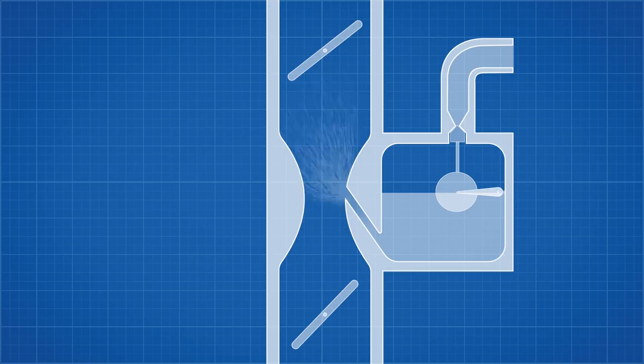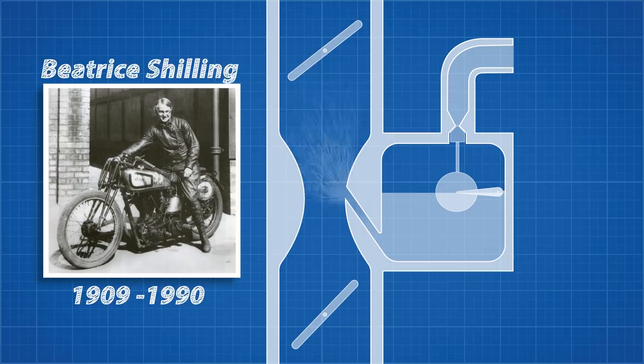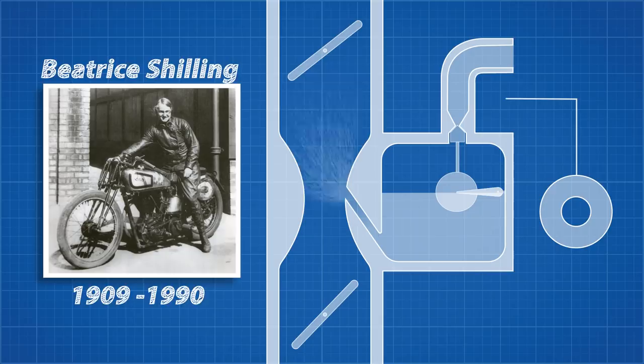With the war raging, Britain needed a quick fix, and this was where Beatrice Schilling came in. Beatrice was a young female engineer working for the Royal Aircraft Establishment. She came up with a beautifully simple stopgap solution: a brass ring installed between the end of the fuel intake pipe and the entrance to the carburetor chamber. This restricted fuel flow into the carburetor to the maximum needed during a dogfight. It did not solve the initial fuel starvation problem, but it delayed the more serious problem of flooding the engine. Most importantly, it could be installed quickly at airfields, allowing Spitfire pilots to be far more competitive until the new pressure carburetors were installed in 1942. Thanks for watching.